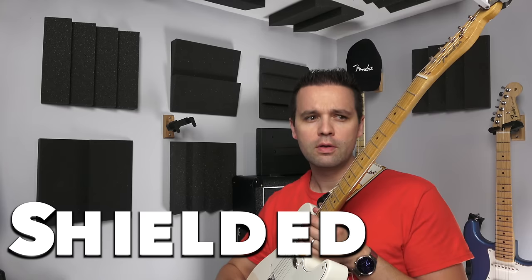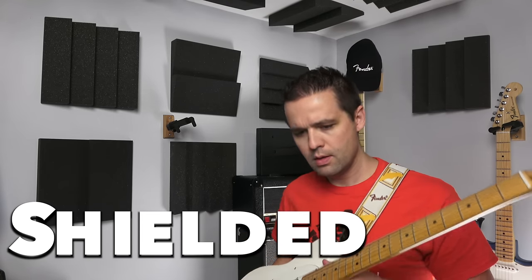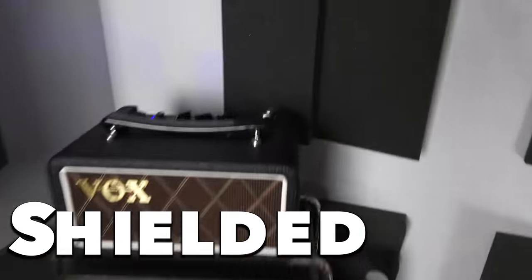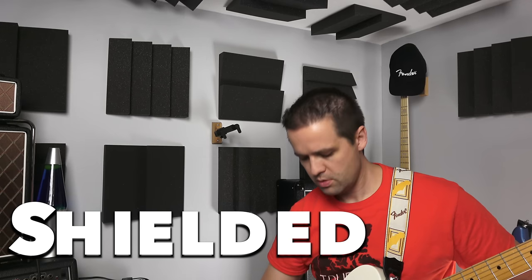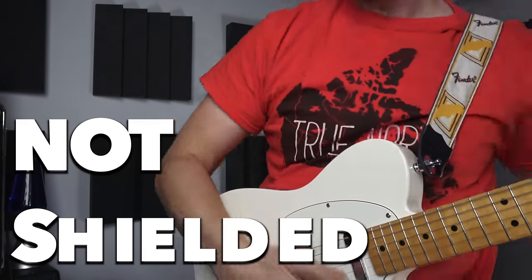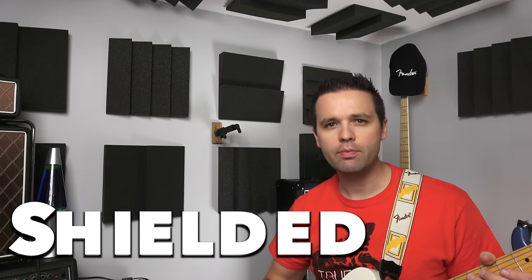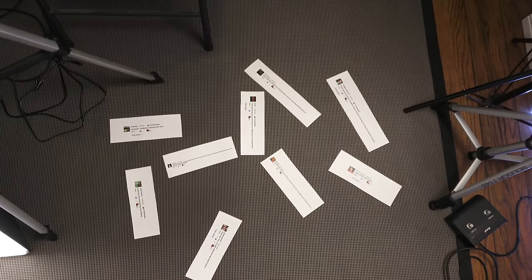Same settings on the amp. Quiet! It's not all gone — it'll never all be gone because this isn't a humbucker. I've got the same settings, same volume. I think that did help. Actually, let's cut back and forth between the beginning and right now — what do you hear? Obviously when I touch it, it mutes it a little bit. I would recommend the paint over the copper tape, just for ease of installation, because that took me quite a while. If you're thinking of doing some shielding to help shield a guitar, I think it's worth it. Let me know what you think in the comments. Alright, play guitar and have fun. See you in the next video. Bye.